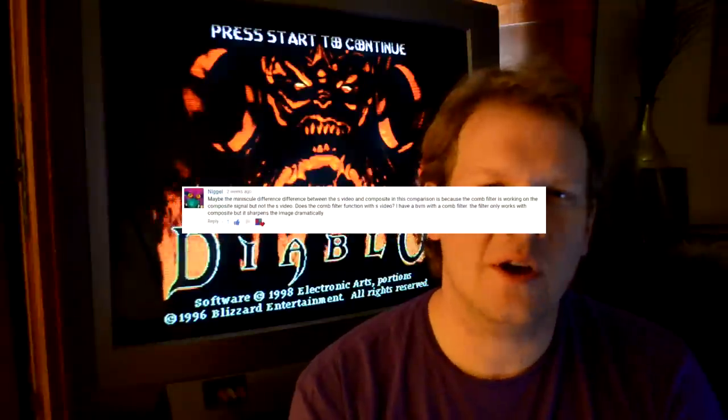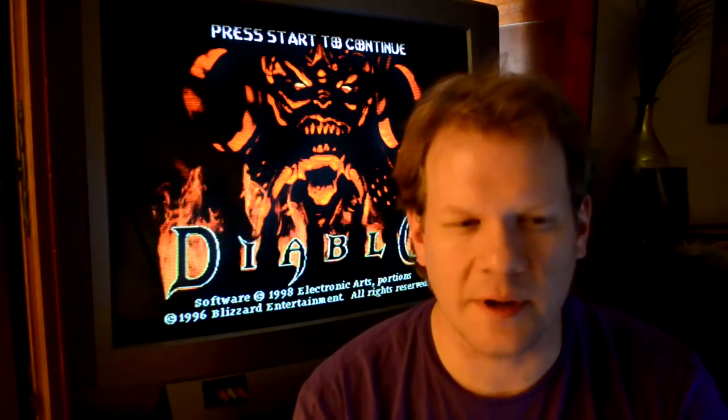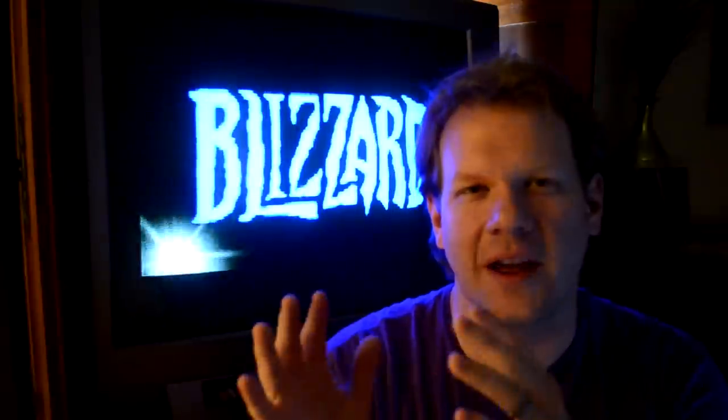The next item is a discussion with Nigel about the VCR video done about two or three weeks ago. We were talking about comb filters. I figured out that with that VCR, it's not actually adding a comb filter to anything when you're playing it straight as a video. The only thing it's combing is if I add a signal into the VCR — like cable coming in, or using composite or S-video inputs — and then output through the VCR. The comb filter is not something you control; it's going to add something good when you're throwing a signal through the VCR.